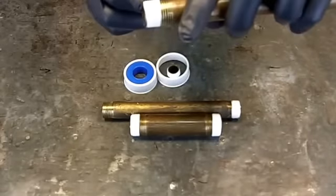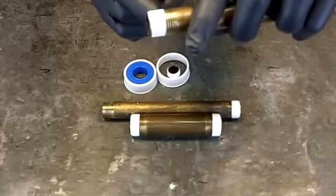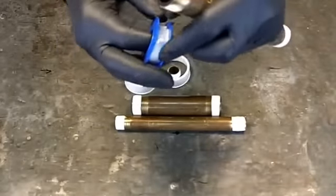My recommendation is to keep it toward the front. Obviously this is half-inch pipe and I'm using half-inch Teflon. We have a piece of three-quarter inch pipe here. A lot of guys would use three-quarter Teflon and cover the whole thread.